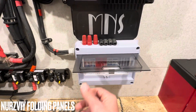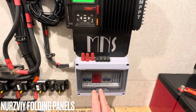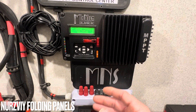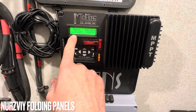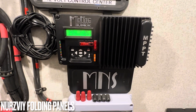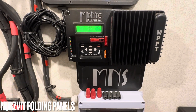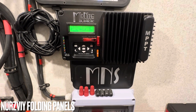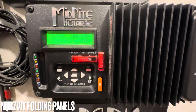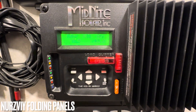Now I've got the NERSVY Solar Epic 400 on there. I don't think we're going to do as well because the voltage is quite a bit lower on the folding panel, and this is a long run — over 100 feet — to get to this controller. The NERSVY is only at 32.2 volts, so I'm getting a little bit of voltage drop running that far of a line lead. That's why I had the glass panels set up in series at high voltage to compensate. So that's not reflective of the panel's performance — it's more to do with my wire installation and the added length. Getting 288–289 watts out of the NERSVY at 32.2 volts input to the controller.